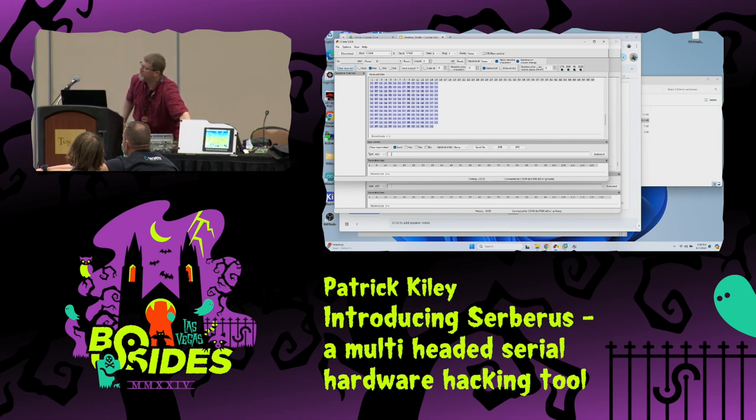With this one, it's acting up a little bit. Now, we need to get in and actually troubleshoot that one. You can see it's coming in, but it's a little bursty and it's a little bit unstable. But it works. We can actually connect to multiple ones at the same time. Now, does anyone know why I actually have to use these converters? What's the difference between UART and RS-232?